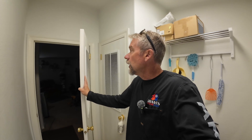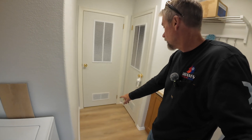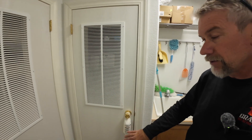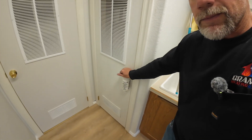Because there's no return air duct work, you will have transfer grills over each of the bedroom doors and the main door entering the mechanical laundry room. It's important to leave these open, including the bottom one. The main door is the same — this is where the air handler is located. There is a small return grill on the bottom as well.